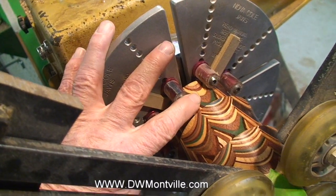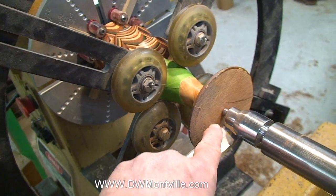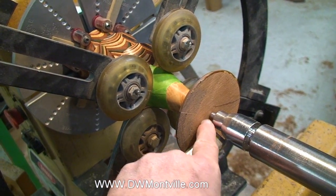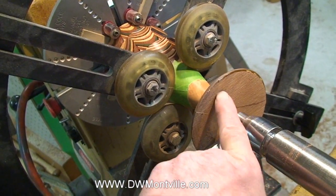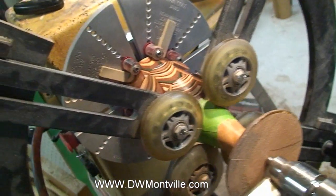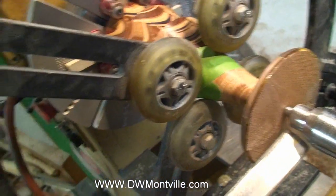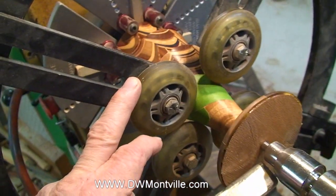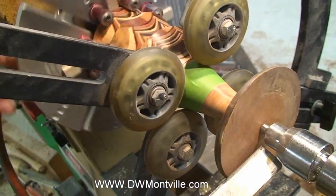Before I thoroughly tighten that, though, you see I've got a nice blunt end pushing fairly moderately down on there to make sure we're perfectly straight before I tightened up the jaws. Then, when I did that, I positioned the steady rest rollers so that they would engage.